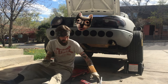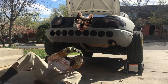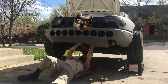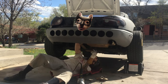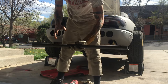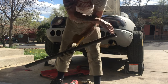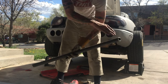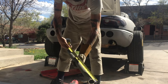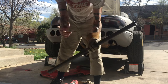Went ahead and prepped them so they're ready for welding so I don't have to take them back out again. The straight across measurement was 28 and a quarter, but I'm going to put a slight bend to it. I came up with 31 and a half and some change, so I've cut 31 and a half and then I'm going to bend it until my overall length between the two is 28 and a quarter. That'll give me the length I need to fit the gap.